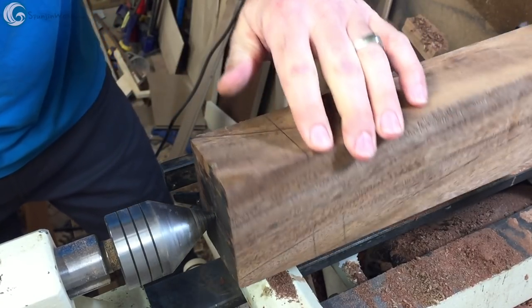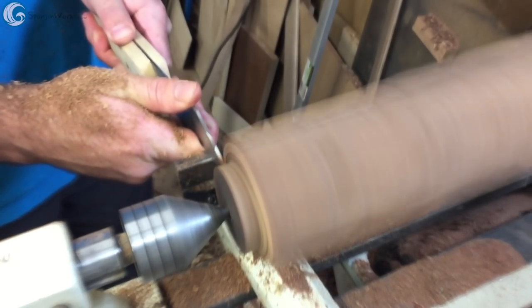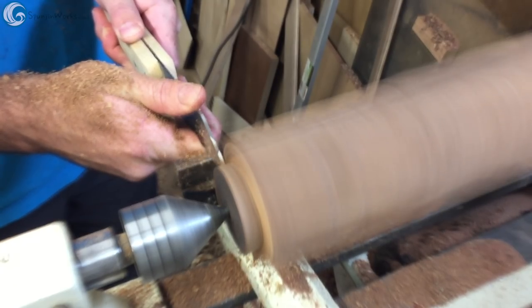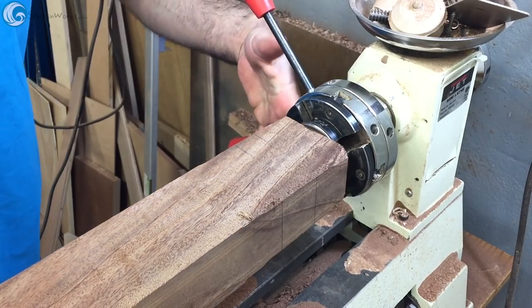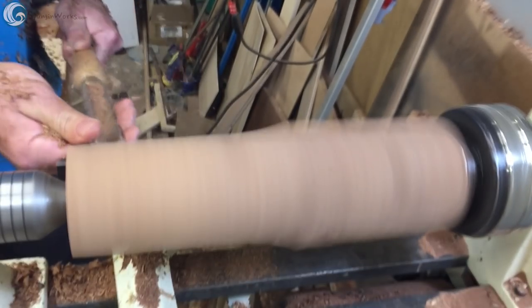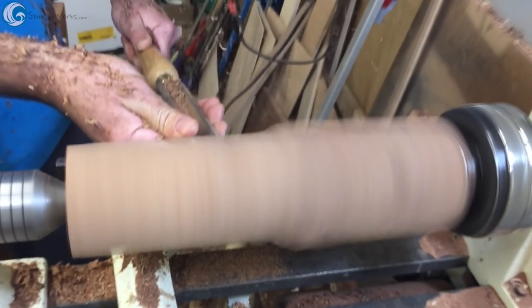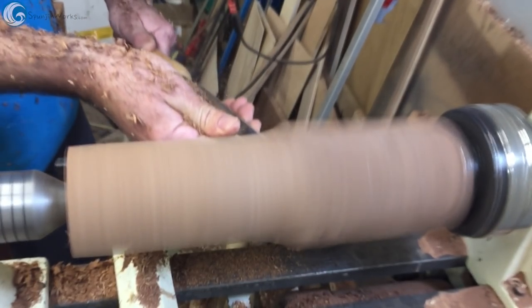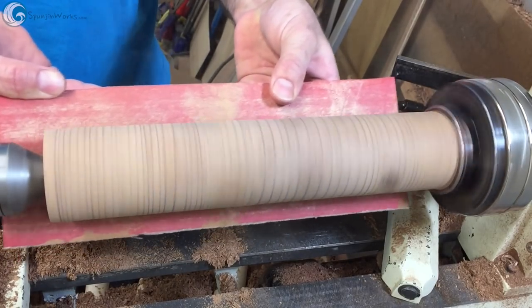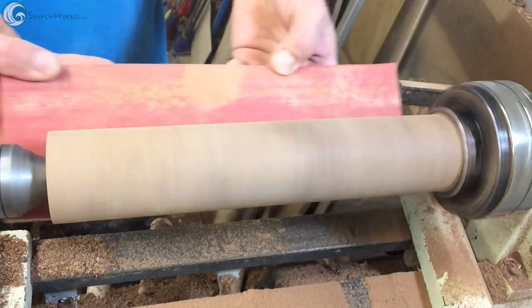The blank is then turned round at the lathe using a carbide scraper. Of the carbide scraper varieties, I prefer a scraper with a two-inch radius over square or round scrapers — I get better results and I feel they're easier to control. The shape I'm going for is simply a consistent cylinder, so to remove any variation from the scraper, I used a sanding belt on a piece of plywood to level the cylinder.